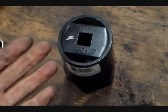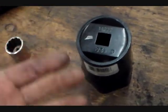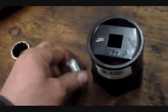But if you're like me and you live out in nowheresville and don't want to drive an hour to the store, go to your bolt bin. You need a five-eighths by one inch bolt, or a similar size, and a nut. You're going to take that bolt and stick it through the square drive hole in the socket like so, then put the nut on and snug it down.